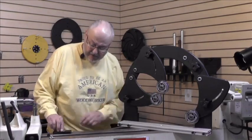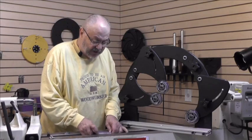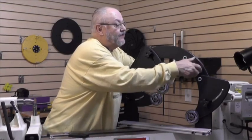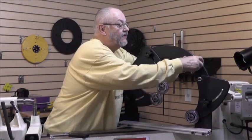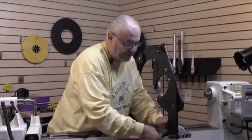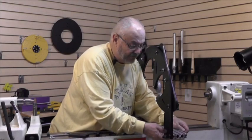The base is a full inch thick of extruded aluminum from the 80/20 people, and it's three inches wide. A clamp goes under the bed ways and locks down with a 3/8-inch bolt. One very cool feature of this design is that it comes apart — it opens — so if you have a piece already mounted on the lathe, you don't have to dismount it. You remove one bolt with a simple five-star knob, and there are ratchet knobs as well.